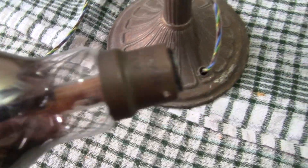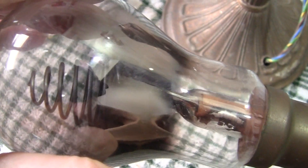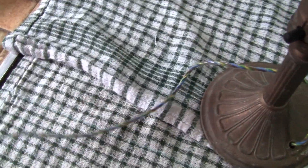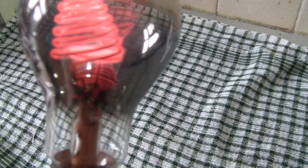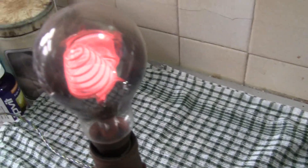The typical lamp we can put in is actually a neon. There's a bit of damage to the neon — it's one manufactured by Atlas, and the support of the beehive was never very strong. The bayonet goes in quite well. I'll plug this in — and immediately the lamp comes on. The holder is actually switched, and the holder is perfectly OK. The lamp itself has been damaged — it's gone black at a place where it doesn't hide the light, so this lamp has probably got many many more years in it.